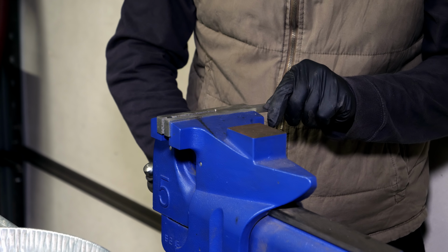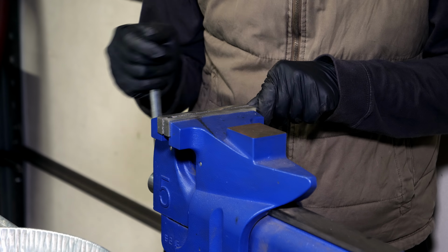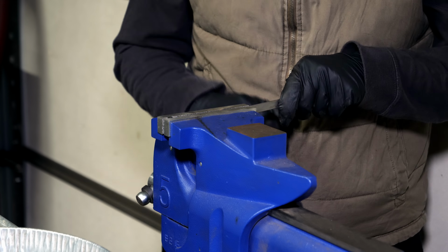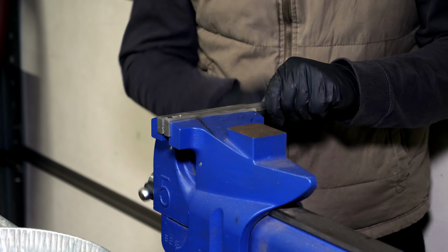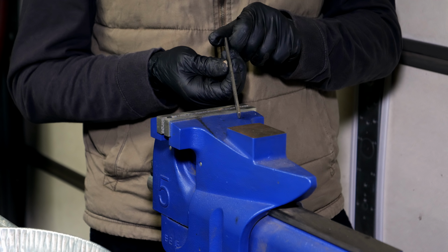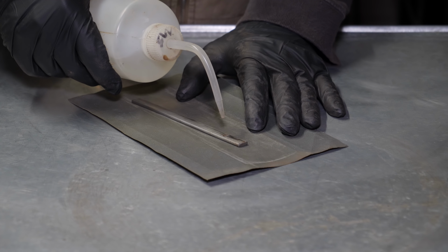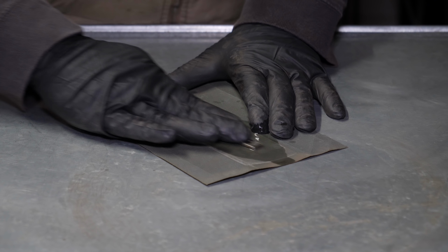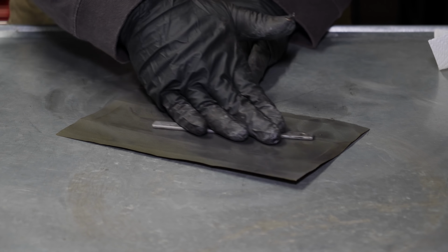So the gib is definitely in sad shape. It's had several issues, one of which is that it's bent. And the other is it looks like someone took it out and drilled some countersinks into it to keep the screws located because it was sliding. There's evidence that it was gouged at one time because it got jammed, or maybe that's from the crash that it had. I don't know.